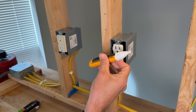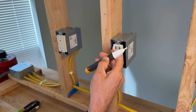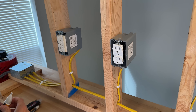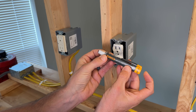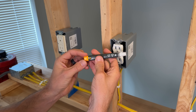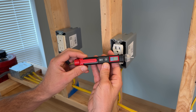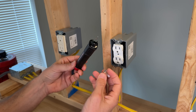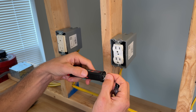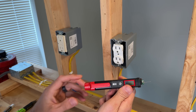The Fluke 1AC turns on but shows no LED and fails to detect — that is a fail. The Fluke LVD2 also fails — I had high hopes for this one, but it did not pass the durability test. The Kaiweets is not even close — it completely self-imploded, isn't even turning on, and had things breaking loose on the inside — complete failure.